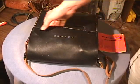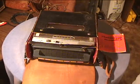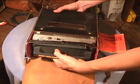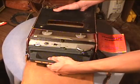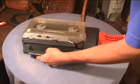Anyway, this machine he wanted me to fix for him. He said the motor would run, but there was no audio. So I fixed it up, and the amp is working. There were a few leaky capacitors, as expected, so let's see how it operates and how it sounds.